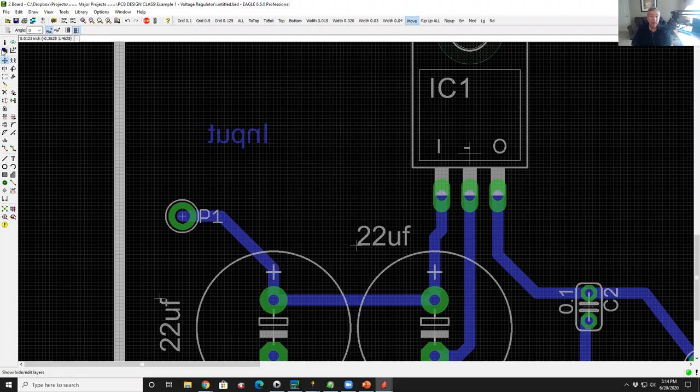Now, this introduces a whole new concept, which is the layers in the database. So I mentioned before, a circuit board has layers: a silkscreen layer, a solder mask layer, a copper trace layer, the insulating fiberglass, and then all that again, copper, solder mask, silkscreen on the bottom. Those 8 layers of stuff in a 2-layer board are all separate layers, logical layers in the database.